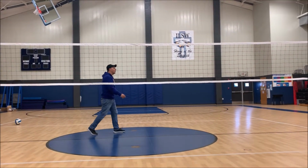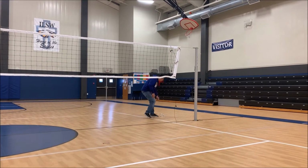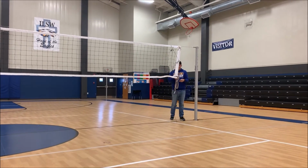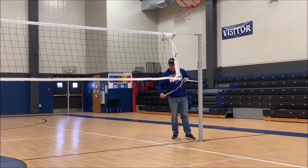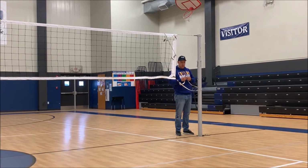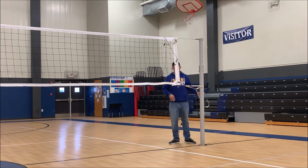The bottom cable is where you're going to use these straps. So you take a strap, the white strap, you loop it through the bottom cable with the loop here. Just take it in here, take it around the post, and then put it into the cam lock like you normally did. Through the bottom of the cam, and then tighten it, but don't make it real tight yet, okay?